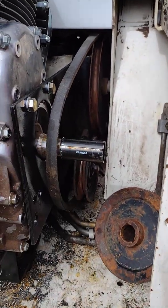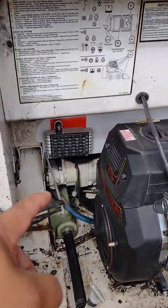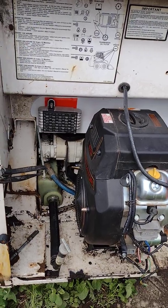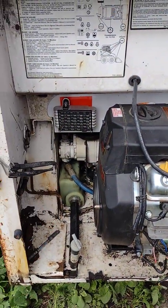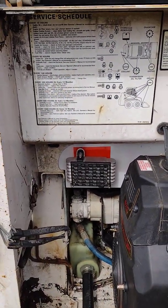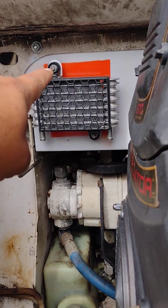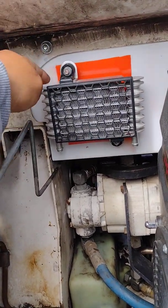So we discovered another shortcut or hack to get this to work. Take a look at that firewall plate — remember when it was out and I had it against the wall, it was black. I didn't sand it down to the metal; I just cleaned it up with a Scotch-Brite, wiped it down, and spray painted it white. I also had orange paint for the door and the wheels. Once the white paint dried, I masked it off with a square and spray painted an orange square. Now with the plate white, it stands out — the orange area is where the oil coolant radiator was going to go. So I drilled a hole and another one, fitted some bolts in the back, and screwed the oil coolant radiator down.